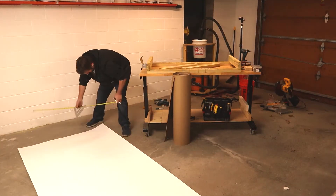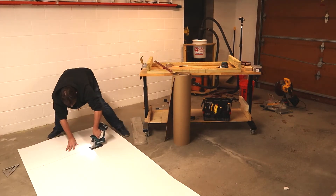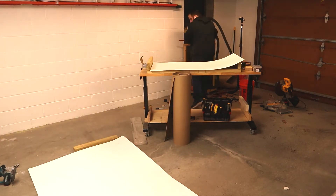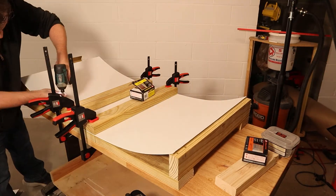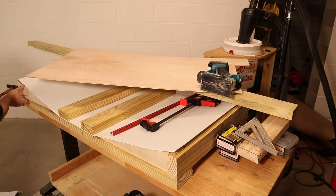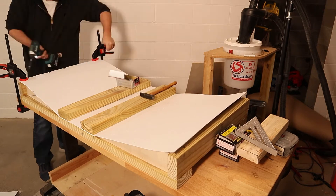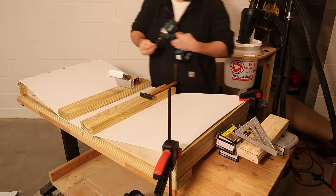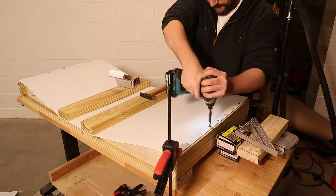Now I need to start chopping up this white plastic sheet. This is great — it's actually fiberglass so it hardly compresses. In fact, the guys over at Ohio Diesel told me you can use this underneath your fixtures inside your milling machine because it works really well. If you overshoot slightly, you're only going to hit the fiberglass rather than crashing your mill. I'm screwing this down temporarily to get a feel for the fit. It's waterproof, it flexes pretty well, and it's cheap — $36 for the whole 8-foot by 4-foot sheet. Screw the edges down with roofing screws, starting from the middle and working your way out — it stops it bulging in the middle and pushes the bulges towards the edge.